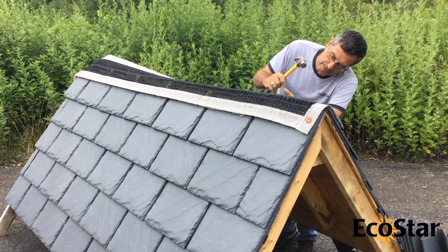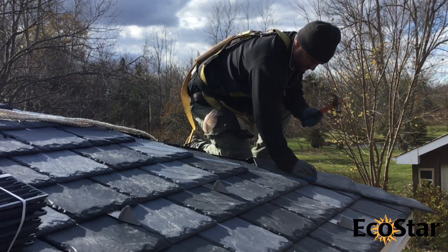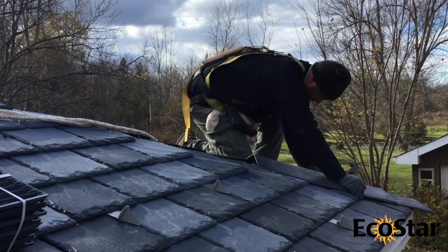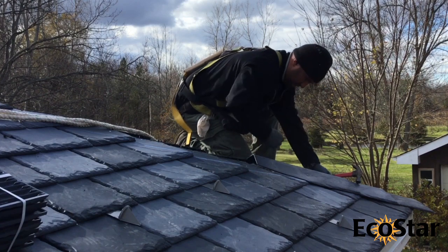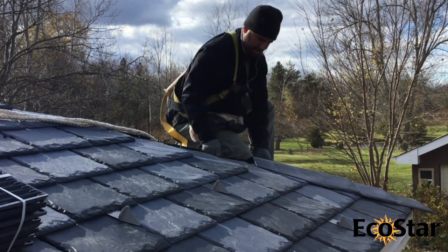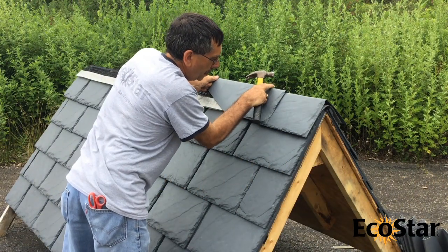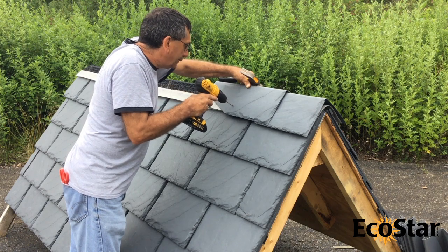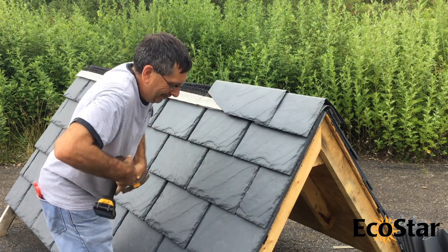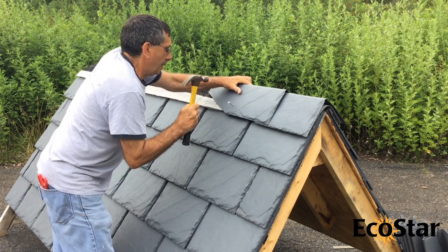When all tiles have been applied to the roof slopes, preformed hip and ridge tiles are applied to all hips and ridges. Each EcoStar product has its own hip and ridge tiles. Hip and ridge tiles are always installed with a 6-inch exposure, regardless of the roof slope or field tile exposure, except for Niagara Slate and Niagara Shake hip and ridge, which can be installed at up to a 9-inch exposure. When installing hip and ridge tiles over Ecovent, first place the tile at the proper exposure and drill a pilot hole through the nail locations using a cordless drill with a bit slightly smaller in diameter than the nail shank. Nail through the pilot hole using an EcoStar 2.5-inch ring shank hand drive nail, driving the nail until it touches the surface of the tile. Do not crush the Ecovent.